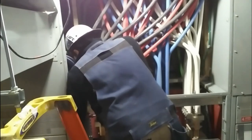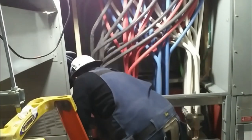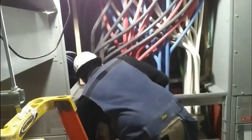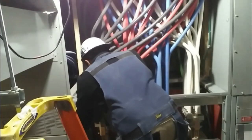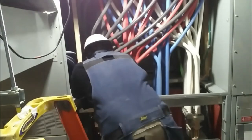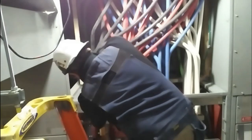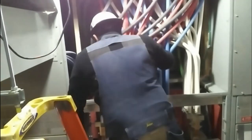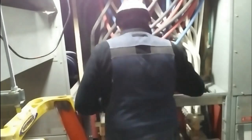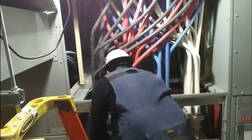You can also go to the code — Annex I, Informative Annex I — and it'll give you some torque specs there as well. One more point: before you do your final torque, shake the wire a little bit just to get it adjusted. I'm not telling you to shake it like an animal — just give it a little shake so it can settle in, and when you torque it you might be able to get a little more pull in there and tighten it up a bit more. Just make sure it's nice and tight, but don't go overboard.